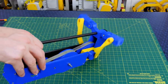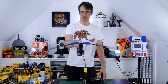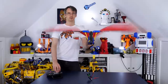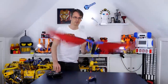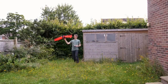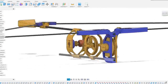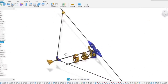A few weeks ago I built an ornithopter, which is a thing that flaps its wings like a bird to fly. I haven't built many successful flying things before but this is something I've always wanted to try. My version 1 attempt had some good characteristics - the motor and double stage belt reduction I built was strong enough and could flap its wings fast enough with what looked like enough force to fly. The overall mass was a bit high though, and as many people pointed out my wings were pointed at the tips, which is where there should be the most lift, so I should have a larger surface area there. Also my wing fabric was a bit loose which isn't efficient.